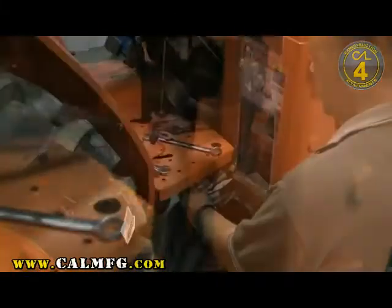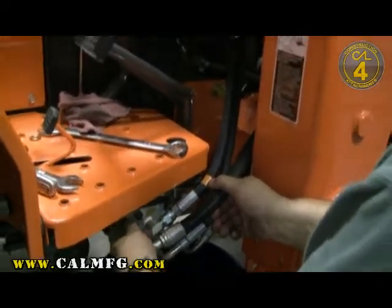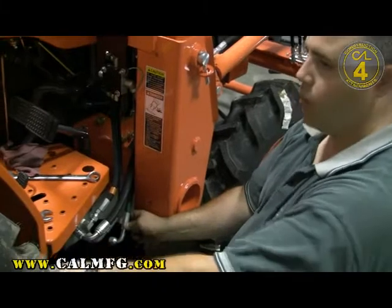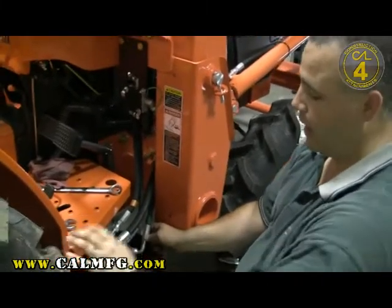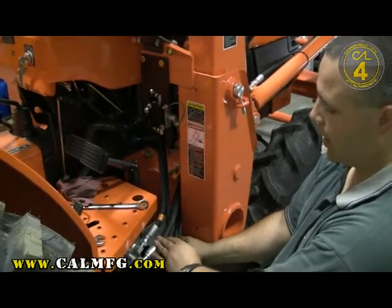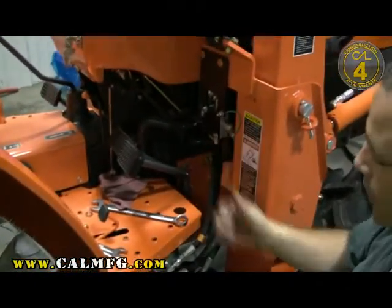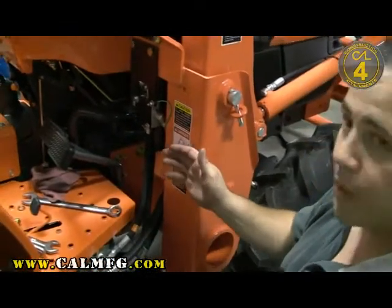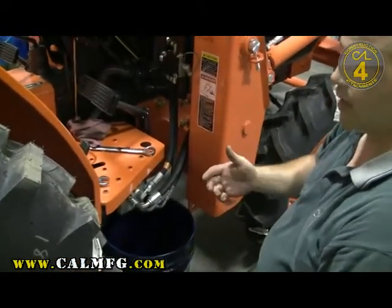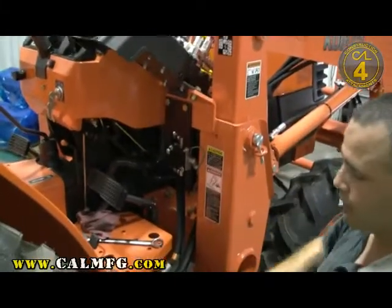While we're looking up right here, it's mentioned in your instructions — we should mention it now. This same connection we just made: if you're installing this on a tractor with a factory backhoe, the green power beyond line that we just removed will actually run all the way to the pressure port of the backhoe valve, and the backhoe will feed back into here. In that case, we want to pull the power beyond line we just removed from the loader valve and put it into T on our valve — that still puts our valve in series, from the loader valve to the one-touch valve and then onto the backhoe. That's only in cases where you have a factory-installed backhoe on any Kubota with a power distribution block.